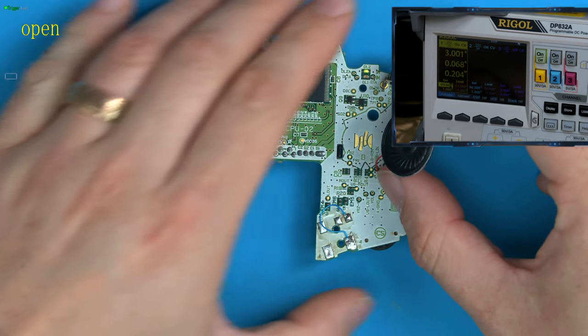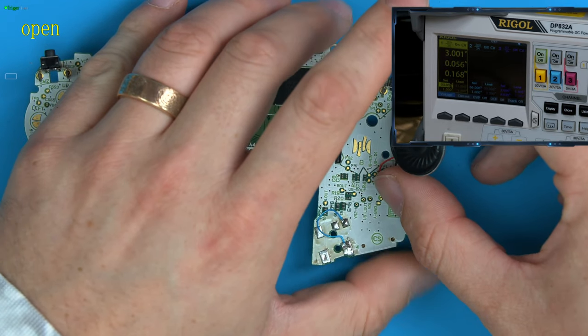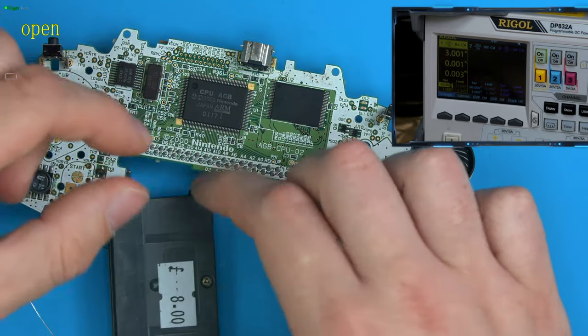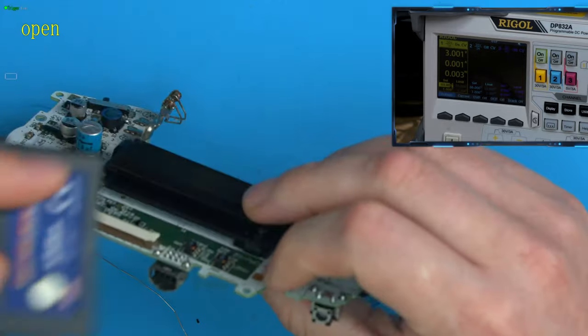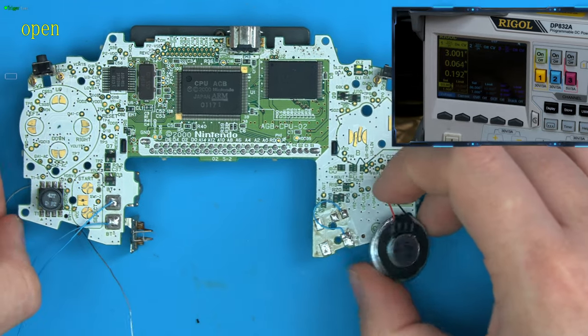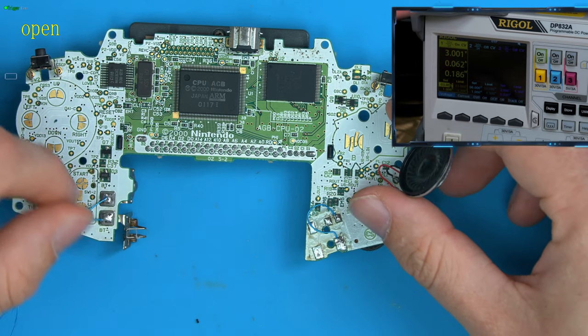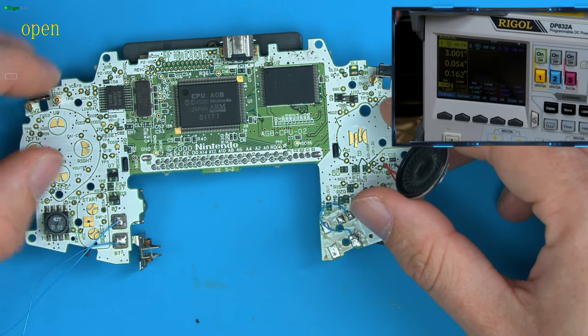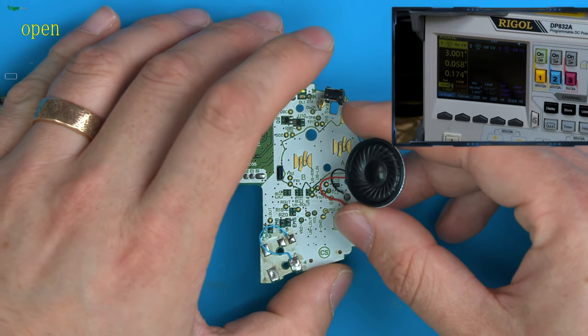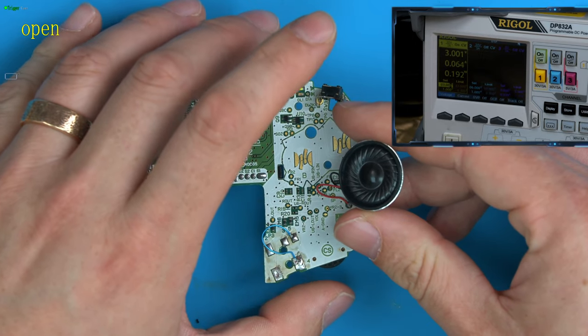And the volume wheel works. We now have sound. I can just check a game in here as well, make sure it's not gritty or any other kind of issue. And if the volume wheel was dirty, then as you're scrolling, you'd hear kind of gritty, choppy changes.